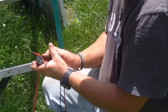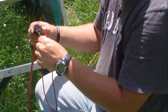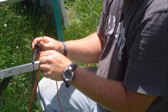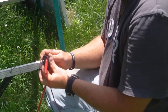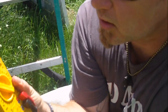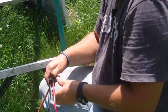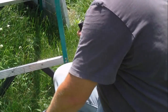Here's the end of the plug, and you're going to look at this the same way you would a receptacle. This one should be your neutral wire, this one's your ground and should be no voltage there. But from here to here - we have 127 volts. So we have voltage all the way to the end of the cord.